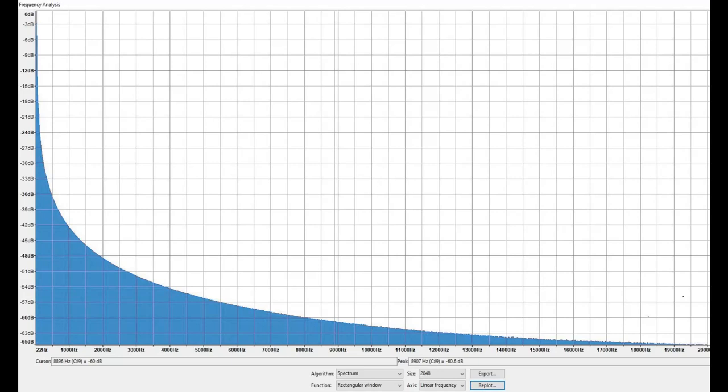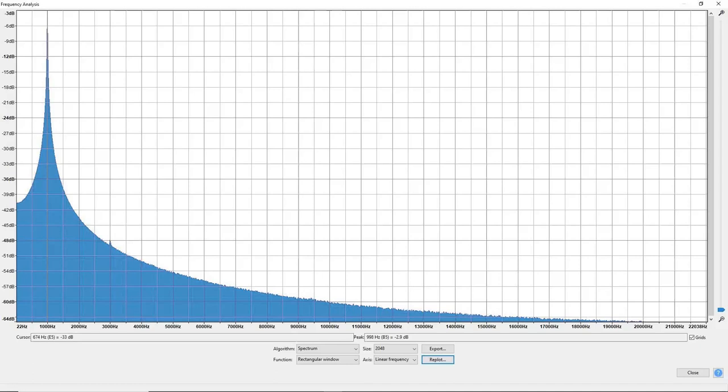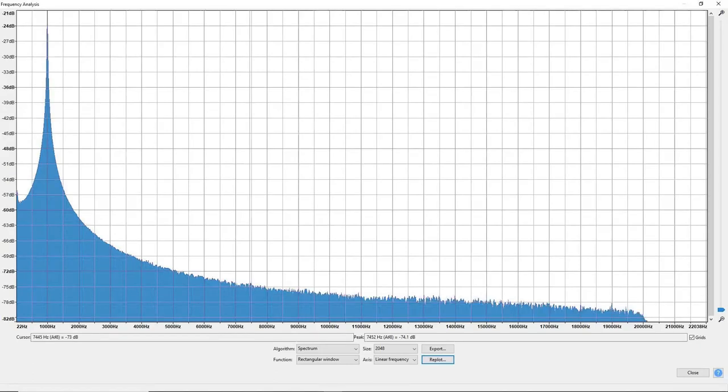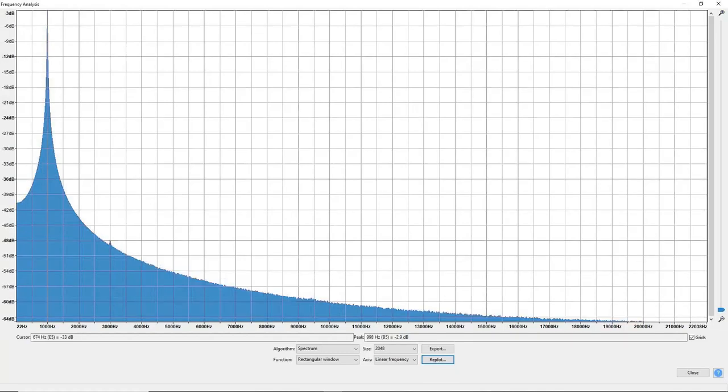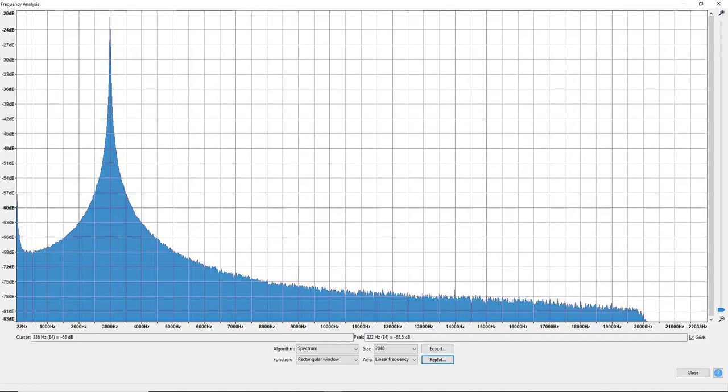Next we look at the two bass drops. They are nice and clean and look like they should do, and the ratios are right. Now we're looking at the 1 kHz and you can see very little distortion on the 0 dB, and the minus 20 is nice and clean. Taking another look at the 0 dB, you can see there is very little spike at the third harmonic. Looking at the 3 kHz 0 dB, you can see there is the start of distortion — that seems to be fairly normal. Looking at the minus 20, you can see there is no distortion at all.